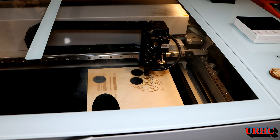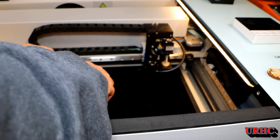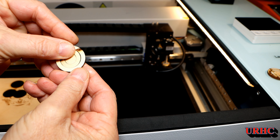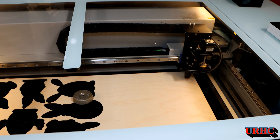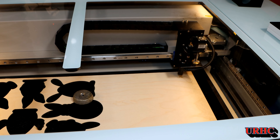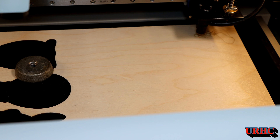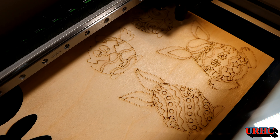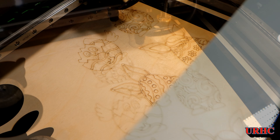One more quick cut, and again you can see there's no black smoky cuts — I'm getting nice clean cuts and everything seems to be blowing through. Looking at them, the kerf is a lot smaller than it originally was. I figured I'd try the little rabbit cutouts I had all the trouble with in the last video, running the same settings with air assist on so no smoke gets up in there. I noticed right away I'm getting a much finer line with less burning, and the overall parts look a lot better.